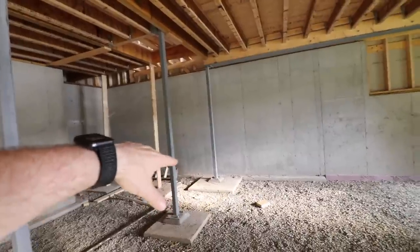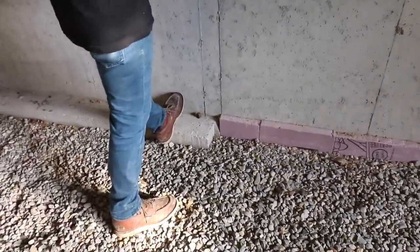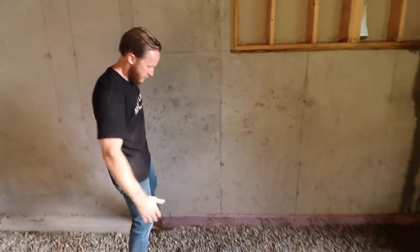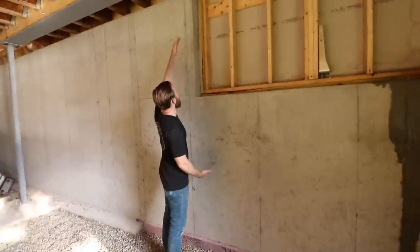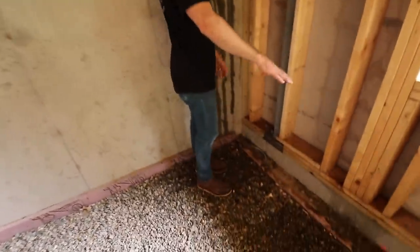Down in the basement — tell me about your foundation design. These walls are below grade all the way, and we're in a walkout situation. I notice some insulation board sticking up as we're getting close to coming out of grade. Here's our footing for the nine-foot wall to the left. We actually have a footing drop here that drops another four feet below, because in Massachusetts we have a 48-inch frost line — we have to be that far below grade to meet code.